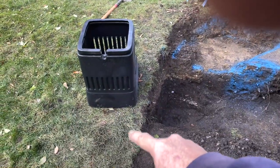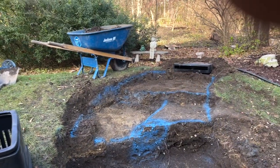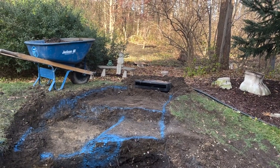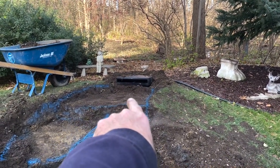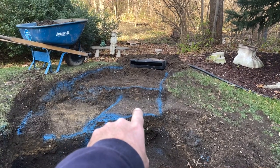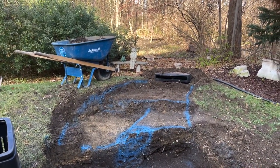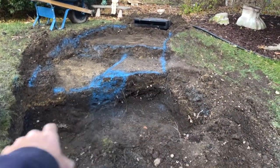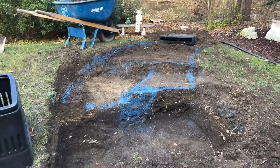We're gonna run plumbing down this side right into our vault that's gonna be sitting down in here. We're gonna run a discharge out the back. So that way, again, as I mentioned before, you can discharge out some of the extra water, and you can do a spring clean out with a discharge valve. We'll have a drop right out of our spillway basin, or our spillway box. It'll come down here. We'll have a nice drop that feeds this side, which is a little bit higher in elevation than this side here. So, you know, it's a short stream now, so we're gonna play around with it a little bit. We probably will not be doing a bib liner on here, since our basin is running long ways this way, you're gonna see water flowing no matter what.